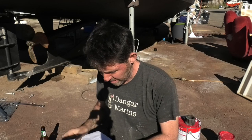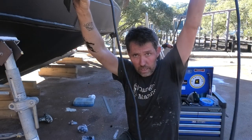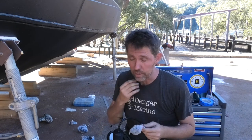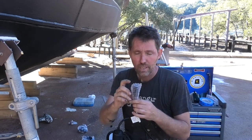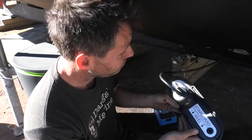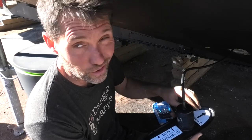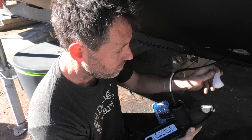On with the instructions. We've found our location, which is clear of any obstruction, so we don't have something in front of the transducer producing turbulent water that will affect the readings. We want clean water flowing over the transducer. This transducer's cable is only so long, and there is an extension to take it to the wheelhouse plus a wire adapter to join the two sides, because they're a matched pair. Make sure you leave the cover on the connector — keep it clean — and definitely don't take the cover off. Probably the most important thing is to make sure you've got the right transducer: starboard side, forward direction marked, keel direction marked. You've basically got three things to confirm correct orientation; once 100% sure, peel the stickers off.